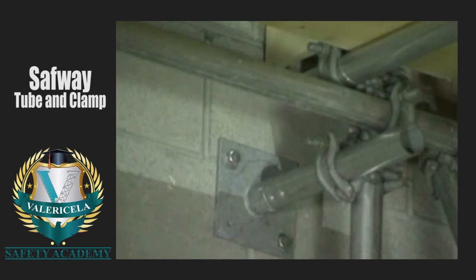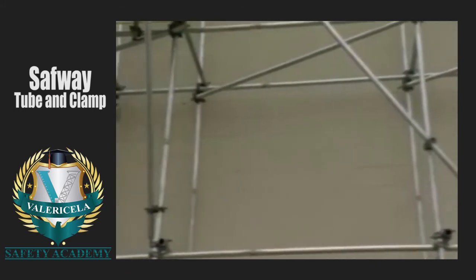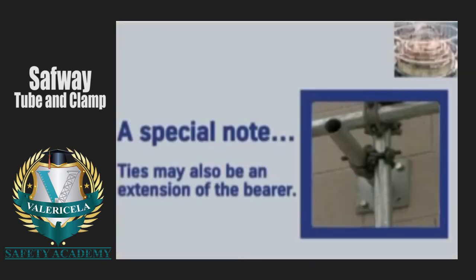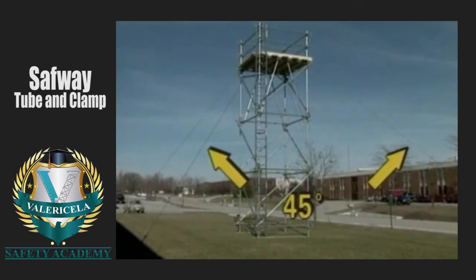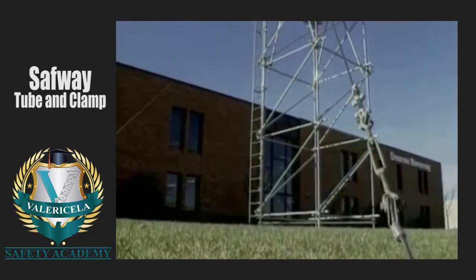Install ties as the scaffold is erected and then fasten them to posts as close to a horizontal member as possible. Place these ties at each end of the scaffold and along the run of the scaffold at horizontal intervals not to exceed 30 feet. A special note, ties may also be an extension of the bearer. The same rules apply for the attachment points of guy wires for guying freestanding scaffolding. However, guys and their anchorages should be designed by an engineer or a qualified person who understands the forces involved.